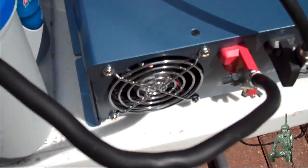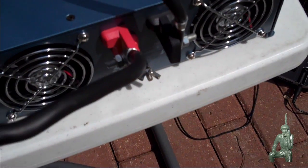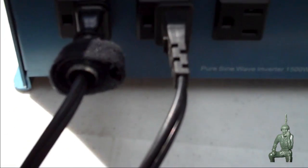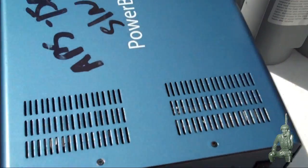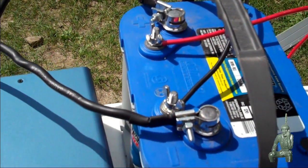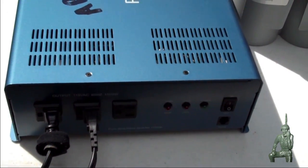The battery is connected here to my inverter. I'm taking 12 volts in on the rear of the inverter as the input, and the inverter is actually converting 12 volts DC to 120 volts AC on the output, where I have my ocean radio charger plugged in and my laptop. Now if you had 12 volt devices you could directly connect to the battery terminals here and run those devices. But the inverter gives us the 110 volts we need for devices that don't run off of 12 volts.